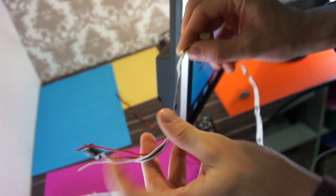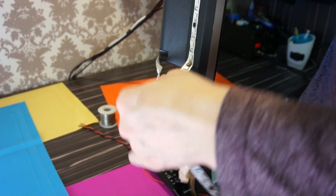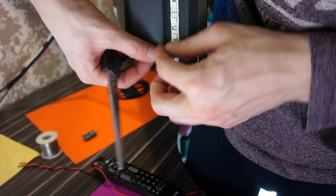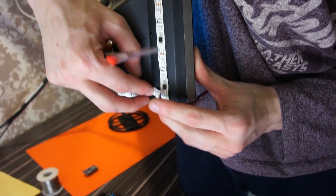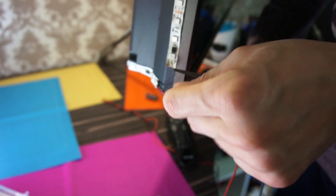Place your LED strip on the back of the TV or monitor. It's important to not bend the tape at this moment, otherwise things will start to fall off the tape. After we placed it on the screen, cut off near the beginning or near the end, whichever is better for you. You need to remember where the start of the tape is and where the end is. The signal wire from the controller connects to the start of the LED strip — if you connect it to the end of the tape, the ambilight will not work.